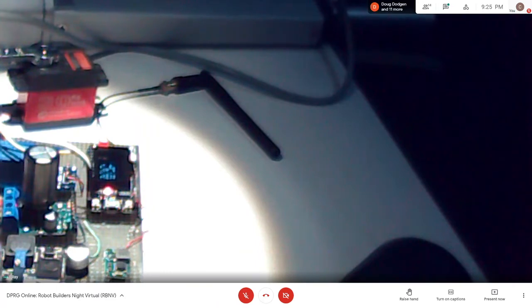I've been a real proponent of LoRa, the transmission, and it seems like it goes anywhere. It goes through walls. It goes around metal buildings. Goes underneath a solar array. And there's still quite a bit of budget left. Here it's only like at minus 20 dB, but you get outside and it'll go down. But you have a budget of like 150 dB, so it's pretty good.